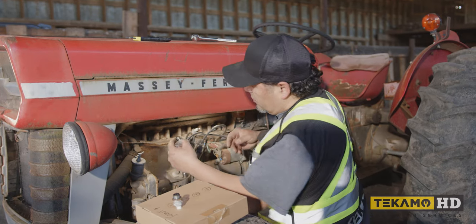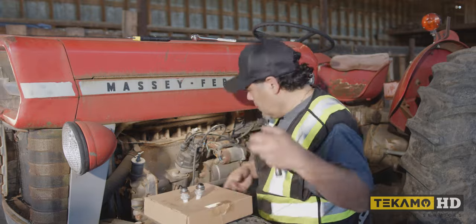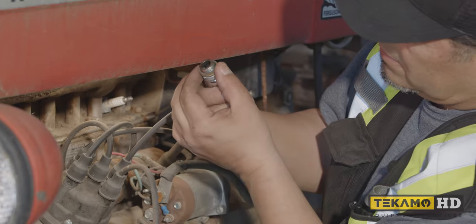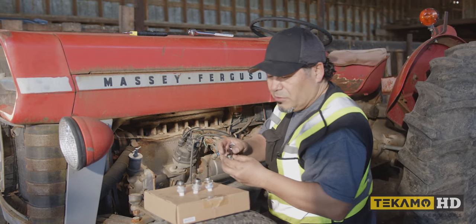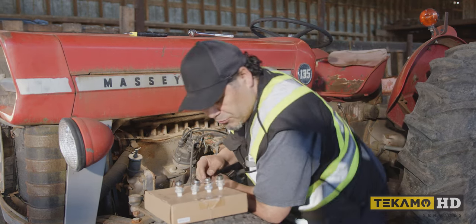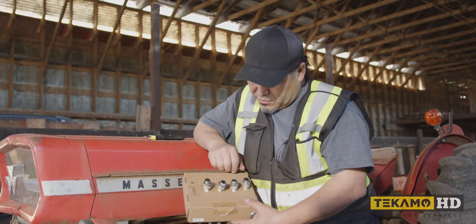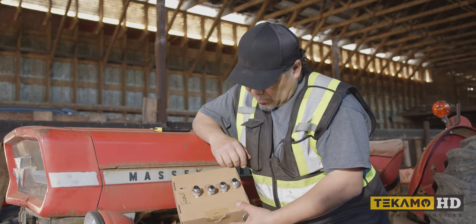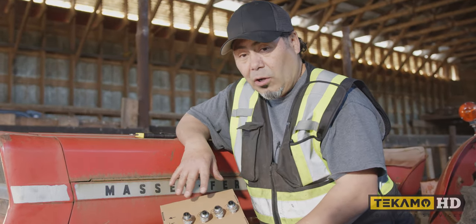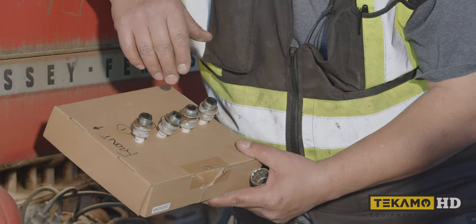Yeah, this one looks to be almost in the same condition. Yeah. So that's two. There. This one here, yeah, about the same. Okay, so they're all about the same. I don't see any that's totally different. I would really worry, okay, if one of these was totally different when you compare it to the other ones. Okay, but you can see they're all about the same, which means that it's running a little rich, but they are all running parallel to each other. Balanced. Okay, nothing stands out.